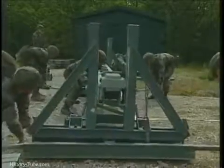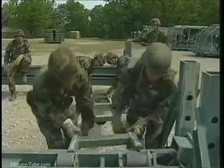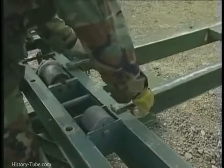Place a roller beam assembly 0.5 meters in front of the F prime peg. Connect two longitudinal girders to the front roller beam. These girders are sometimes known as ladders. Secure them with dowels.